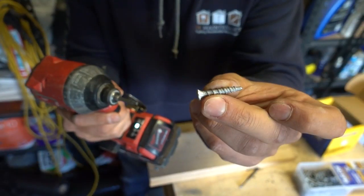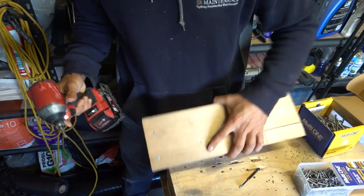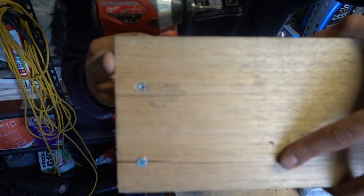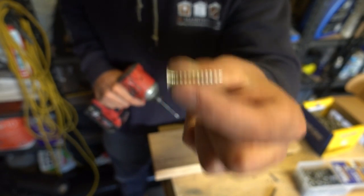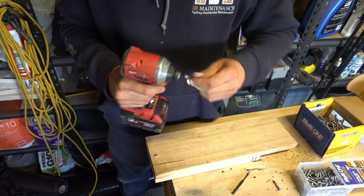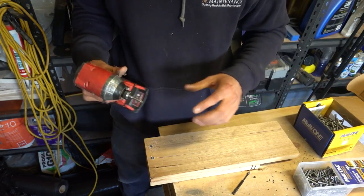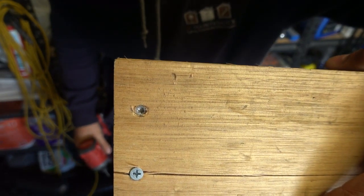Let's see the difference when we switch over to the MultiOne screw. You can see how much better it sits in there — I can shake it around and the screw doesn't come out. It actually hasn't split the wood whatsoever and we've got a perfect little finish. Let's do it one more time to confirm: regular 30 mil timber screw splits all the way across. But with the MultiOne and torx drive, that's such a solid bite. I've completely embedded that section in there and it doesn't split the wood whatsoever.